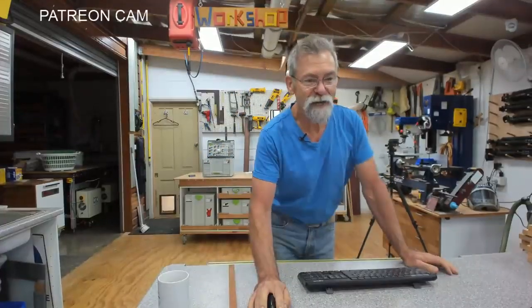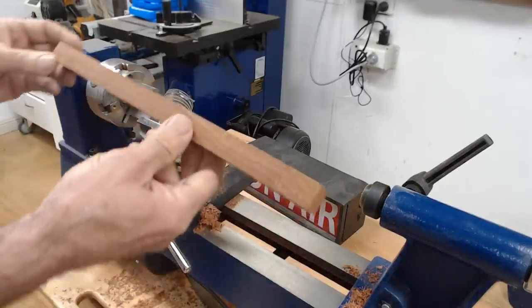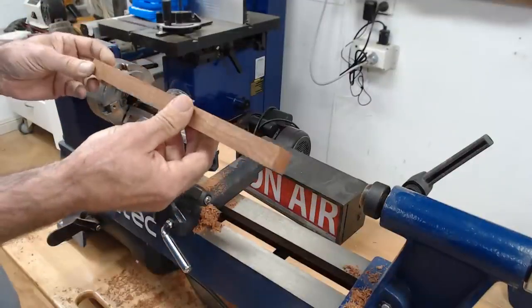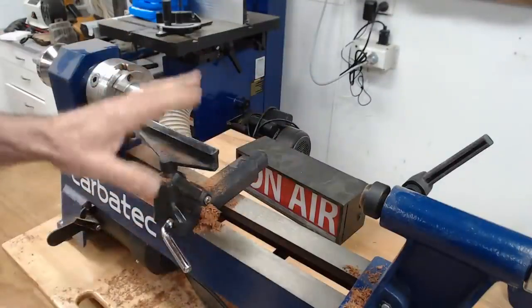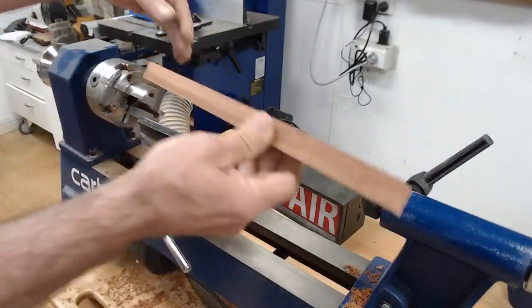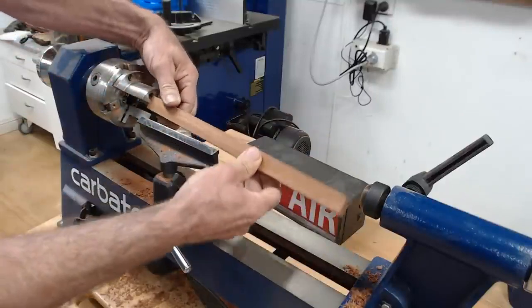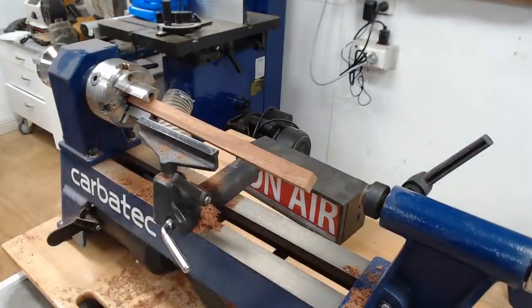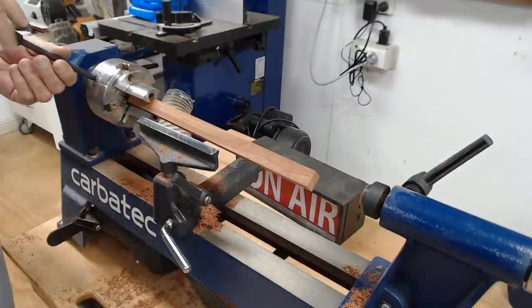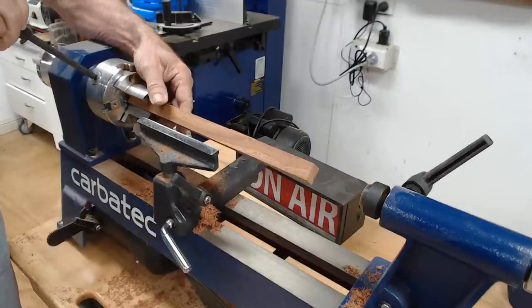All right, I'm going to switch the cameras over, and you can see, there it is. Now I've made basically a dirty big pen blank to turn these plugs out. This is cedar, so it shouldn't be affected too much by the weather. Here I have just a mini lathe, and I've got some jaws on the end here that aren't really designed for this. They're pen turning jaws, but I can slide that in there, and then I'll open up my drawer down the bottom here, and I'll get this and tighten it up, and you'll be amazed how they line up quite well.